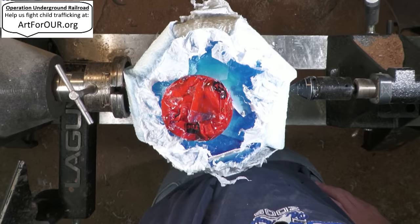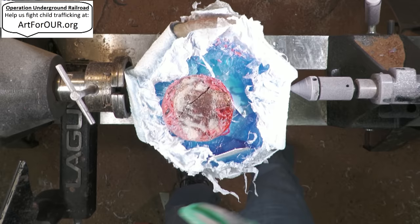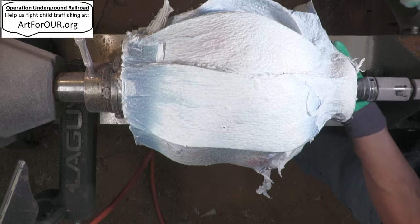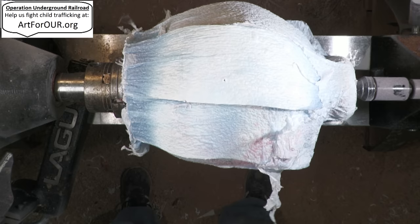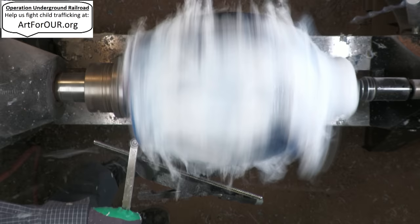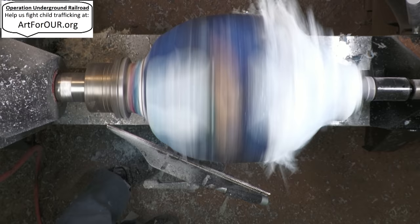I like to triple bag these because, man, all you need is one leak and you will ruin your pressure pot. One of my videos shows that in every painstaking detail. Thank you to whoever suggested rice. Dry rice is great. I used to use sand, it was too dusty. Stuff's much more lightweight, so I can actually transfer this inner liner pot from vacuum chamber to pressure pot without a problem. And it doesn't rot, because here in Utah it is super dry and doesn't seem to go bad at all.